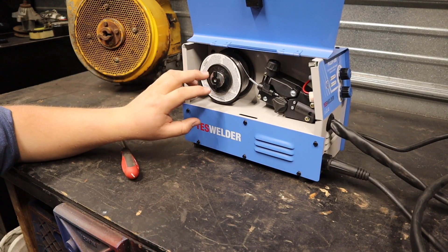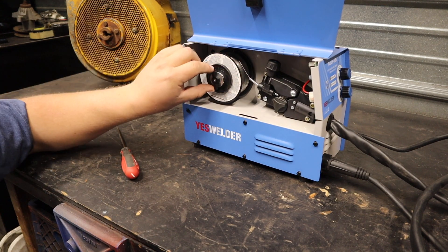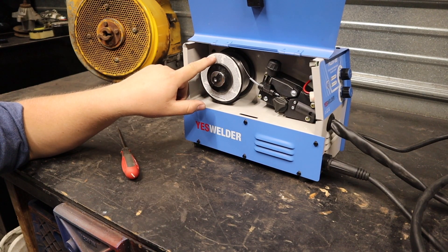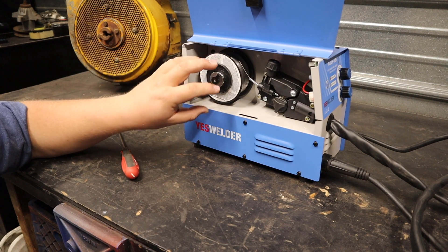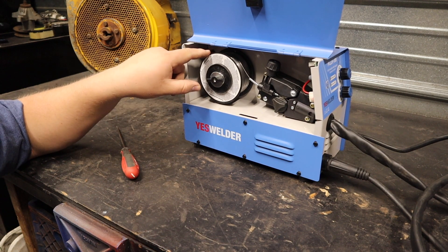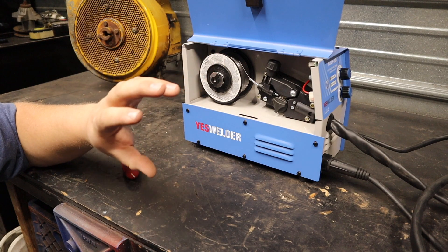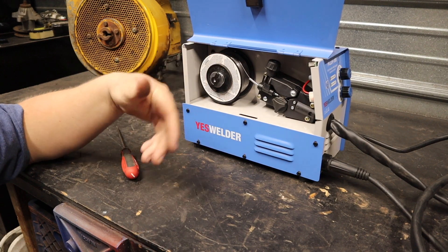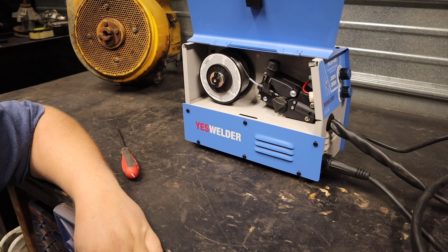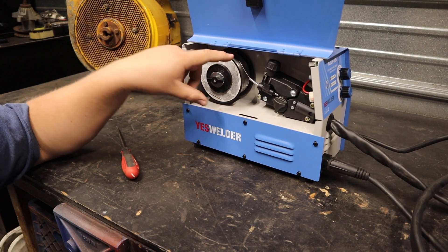Back here at the machine, you don't want your spool tension to be too tight, because you don't want to make the wire drive mechanism work harder than it has to. One way to know if it's too loose is if your spool is just wanting to unspool on you. There's a lot of friction on this spool rod — the little plastic rod that the spool sits on. You definitely just don't want your spool to be too tight or too loose. If it's too loose, it'll unspool on you. If it's too tight, you're going to make your wire drive mechanism work too much. Just put it on there tight enough to where it doesn't want to unspool on you.